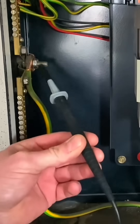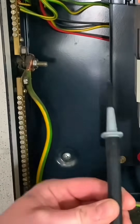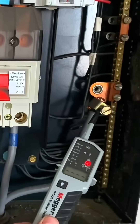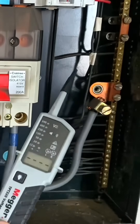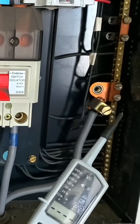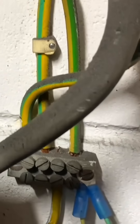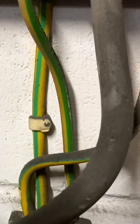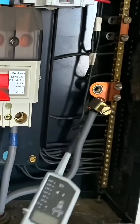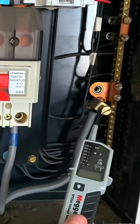The next test is between the protective conductor and neutral — least dangerous conductor first, being the earthing conductor, then the neutral. You'll notice we get a continuity beep with no voltage on the instrument. The reason is that the neutral and the earthing conductor are connected together below, as this is a TN-CS system. That continuity beep is expected for that reason.